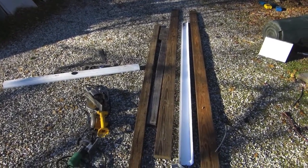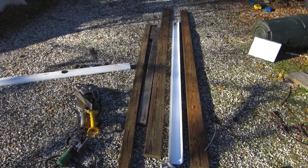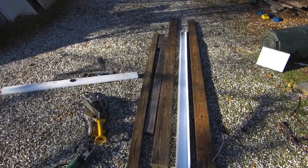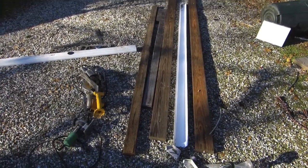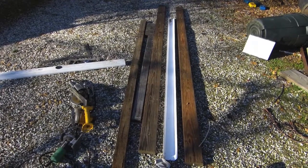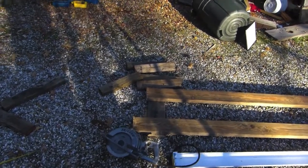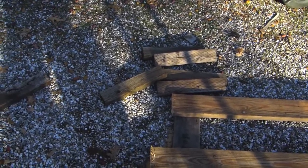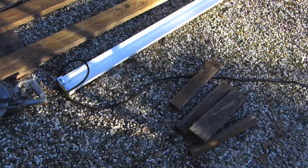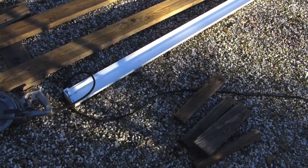Where you place the 2x6 rails on those cross supports depends on what kind of planter you're going to support. You might have those 2x6s only 8 inches apart for a paint-bucket-type planter — you're thinking about the size of the base. For a greens garden using a 40-inch planter, I'm going to go the maximum distance apart: 16 inches. I cut my 2x6s to 128-inch length. Here are the 2x4 cross pieces — five of them, 16 inches long. The off-cuts of the 2x6s split, which is another reason it's good to get 12-footers so you can cut the worst split ends off.